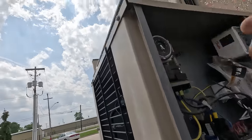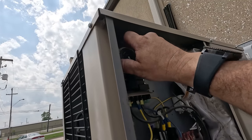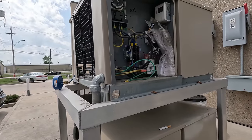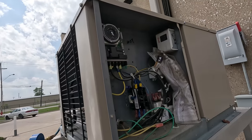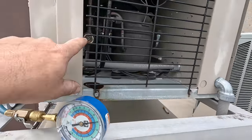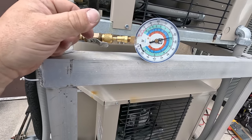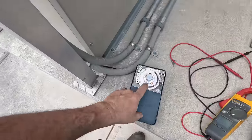These gears are crap — it ain't wanting to rotate. I think it's jammed up. Okay, let's say it didn't go into defrost and it just started to freeze up. I could see that coil would start to freeze, then it just dropped in temperature because you had no airflow across it. I could see that as a possibility. I'm about ready to strip the gears out. We're going to replace this clock — I'm going to guesstimate that's probably what's going on. For right now I think that's going to be the smartest bet, because right now the side glass is full. Clock was tracking but if it's not rotating by hand freely that's obviously not right. Right now it's not acting up, so it could have very easily not gone into a defrost and they're not able to see behind the evaporator to know whether or not they've seen frost behind it. So we're just going to change the clock.